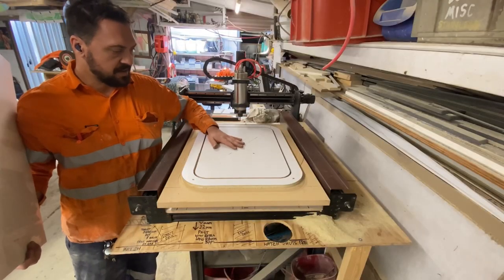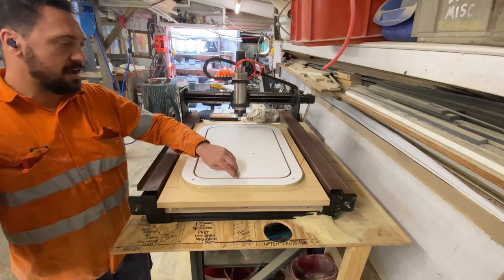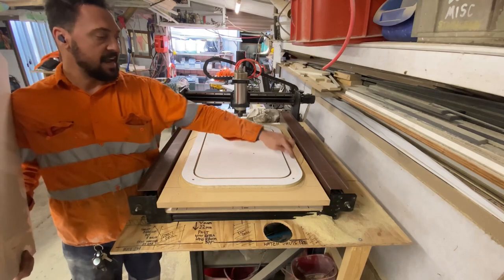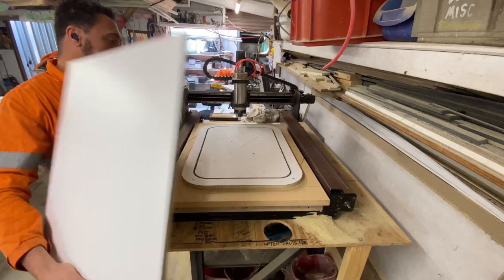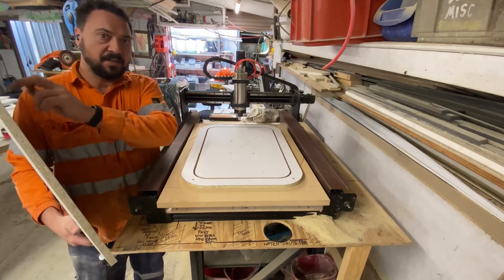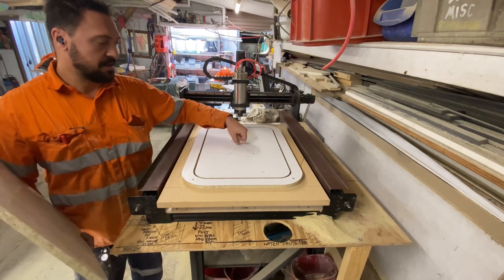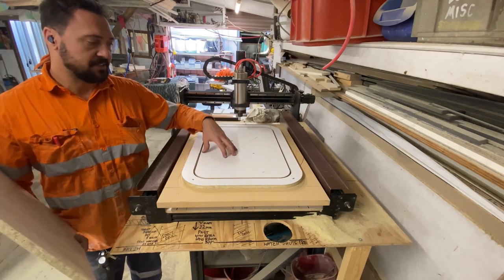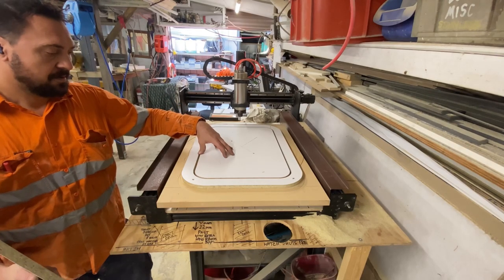While I've got this screwed down and it's perfectly spaced with a 6mm wall thickness, I'm going to screw this on. It screws this outside and this plate to this piece of wood. And then I've got them marked and I'll mark it on here so I know which ones go where. I'll cut it in four like that so I can split it apart easy. Put iron on melamine on all of the surfaces that will have fiberglass on them, and yeah, that will be good.